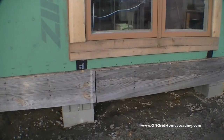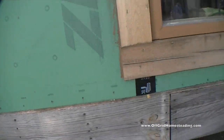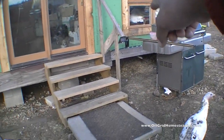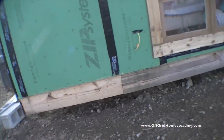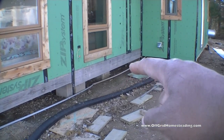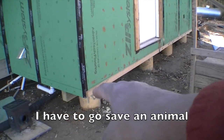They've actually gone around the entire house and put a mark where the metal's going to come up to, and we'll have to do a filler piece of cedar, something in there around the whole trim or the base of the house so that it looks consistent, because we've got different height joists. We got 8 inch there, 12 inch there, 12, 12, 8, and then it changes on the back side. I think we got 10s. We got 12 on this end. These are 8s. That's 12. None there, because our board's coming all the way down to the base of it. And then these are 10s.